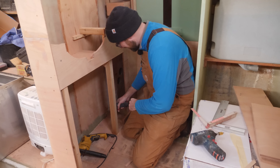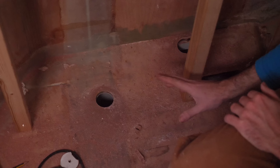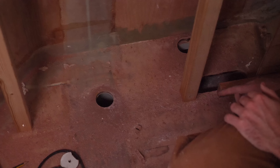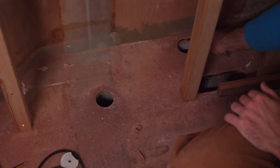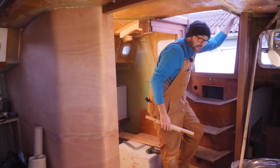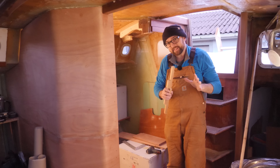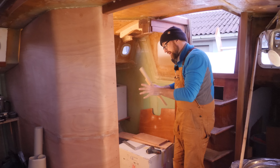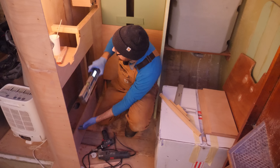Okay, so we've got plenty of room there. Drilling thusly completed to full satisfaction — I've got three holes. There's a big one right here for the conduit for the nav station, a smaller one for the hot and cold water for the galley, and this one for the sink drain, and the heater fits right here. The very last thing I want to do tonight is to just get that bottom piece of the vanity glued and screwed in place, because if I do that that means I can start priming tomorrow morning. Let's just check that this is reasonably level — that looks about right.